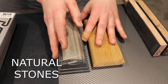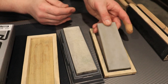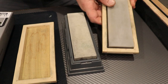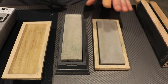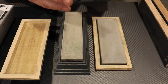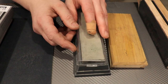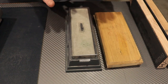First we have natural stones. This can be your Japanese water stones or your Arkansas stones like these. This is an Arkansas translucent — a somewhat special stone that lasts forever. And then this is the same type of stone, just a lower grit — this is an Arkansas hard. These are great beginner stones and affordable. Natural water stones can be relatively affordable. These you're supposed to use oil on, though you can get by with soapy water. They're considered an oil stone. Japanese water stones take water, but these are for simple steels and carbon steels. You don't want to use these for any high carbide or high wear-resistant steels.